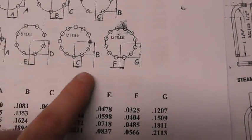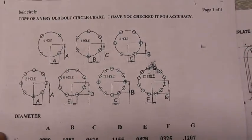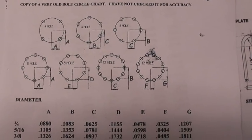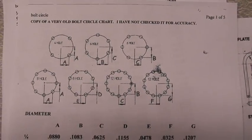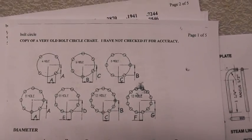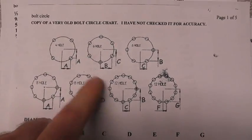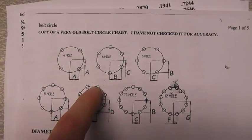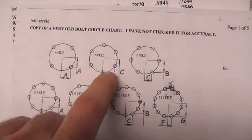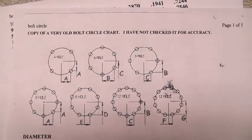That's a really handy chart — it makes things simple because everything's laid out for you and you don't have to do any math. You are limited to four, six, eight, and twelve hole patterns, but it's a good chart. The easiest way, though, is with a digital readout. If you have a digital readout on your mill and haven't used the bolt circle function, you should really try to learn it. It's very simple — all you need to know is the diameter of your circle, how many holes you want, and the starting degrees, and it tells you everything.